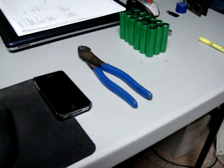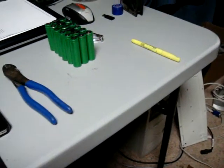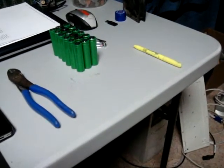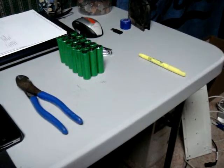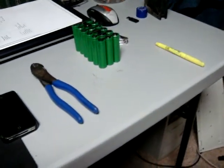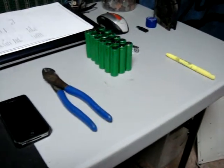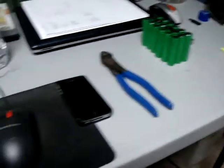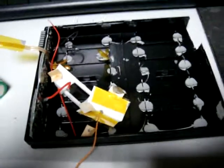Just with a pair of dikes and a highlighter — that's all I'm using. I find a non-conductive bar is always helpful to have because you don't want to stick a screwdriver in there and pry with metal. I use some sort of plastic, a pencil, or a pen — anything. So I can jam it underneath the cells and kind of pry them up and get them apart.